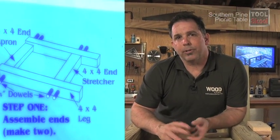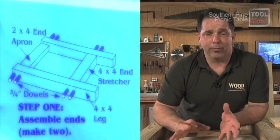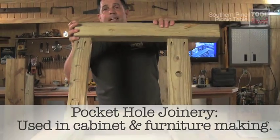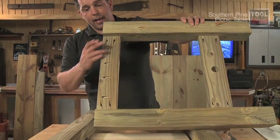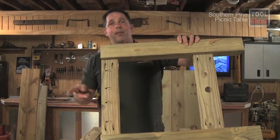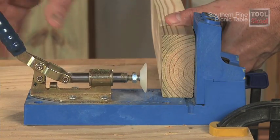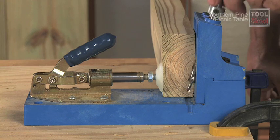We have to talk about our joinery method. The plans call for doweled joints — a very strong but very visible joint. I went 180 degrees the other way: pocket holes, which are almost invisible. You don't see them until you flip it over. Pocket holes are used a lot in cabinet making and fine furniture. They're created using a tool like this Kreg jig — a piece of wood is clamped into the jig, then a special step drill bit is used to create a countersink hole for the screw to sit in.